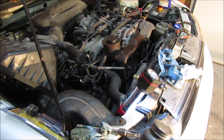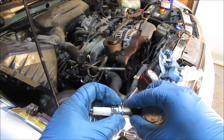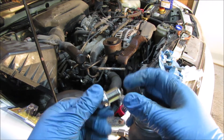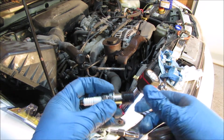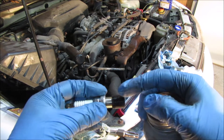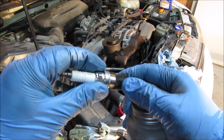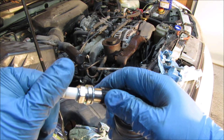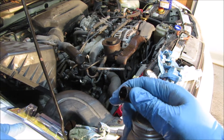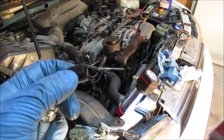I'm going to put a little bit of anti-seize onto the threads of the spark plug, then thread the sleeve onto there, and after that put the red thread locker on the outside of the sleeve. The idea is: anti-seize on the spark plug threads, thread the sleeve on, red thread locker on the outside. That way when it cures overnight and I go to back out the spark plug, the insert will stay in there while the spark plug comes out. Then I can use the little piece to spread it open so it bites into the head and doesn't thread out. Seems like a logical way to go.